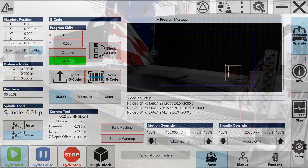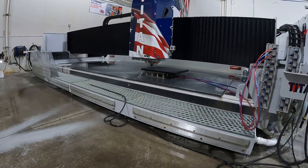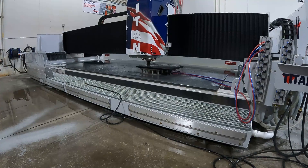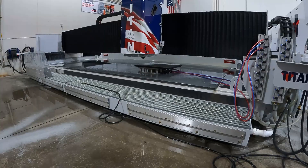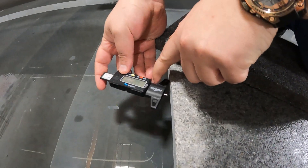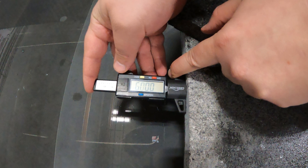Start the program at the beginning to use z-wheel one to remove the three-sixteenths inch of material — the z-wheel is proven so let it go all the way down the edge. Position one has already been tested so let that run all the way down as well. Tool number two, however, we'll stop three-quarters of the way down the edge again. Save it out, move the Y-axis out of the way, dry off the material, and feel that the removal wrapped around if it was supposed to. When we measure, we'll see we have nine thousandths removed — the value we set earlier.